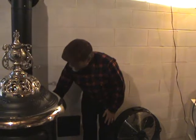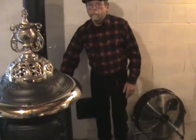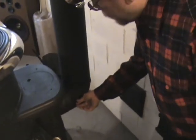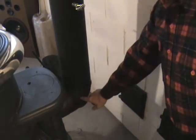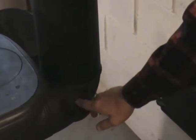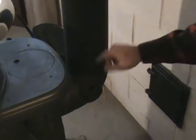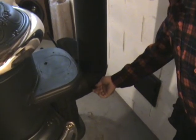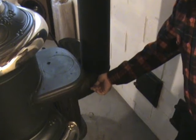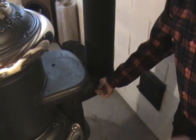We're going to have to do two videos — there's too much to fit into one. I want to show you this check damper right here. Not many stoves have them these days, but this is sort of like a modern barometric damper. It cuts the draft through the stove, and also if you burn wood or bituminous coal, this allows extra combustion air to burn the gases before they escape up the chimney. It increases the efficiency of the stove and prevents creosote formation if you burn wood. We'll talk about wood burning later. We'll say bye now and we'll see you in the next video.